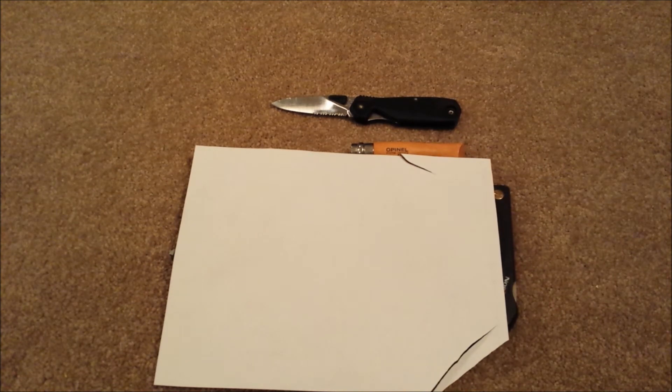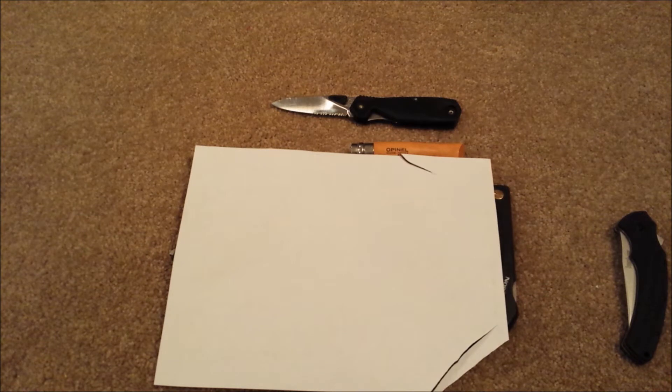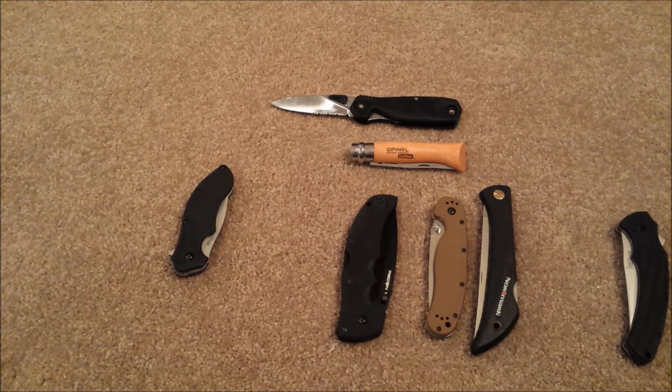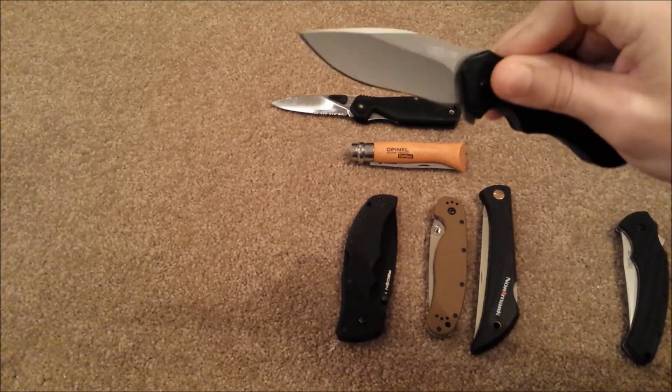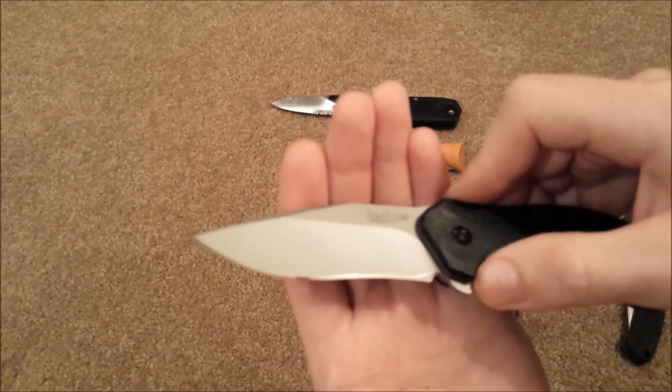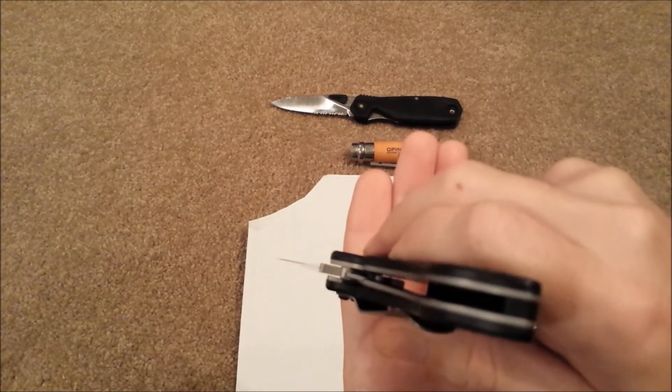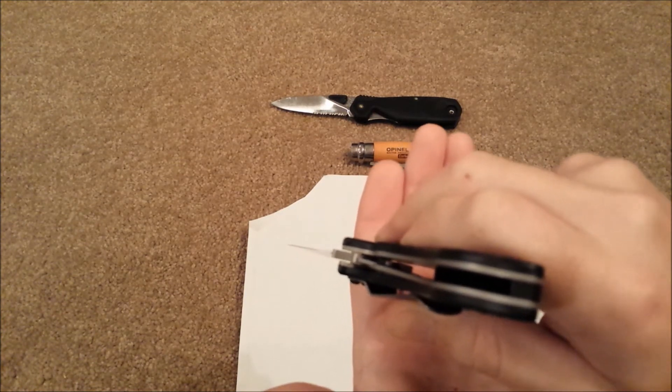For the combo edged version of the Trimmers, it's a little bit thicker. The actual straight edged portion of that combo edge, you're going to be looking at between 0.40 and 0.45 millimeters. The Kershaw One Ton is next on the list at 0.65 millimeters. Kershaw Compound is 0.4 millimeters. Kershaw Clash — this is another one I want to note because the Clash, at least mine, consistently come in at 0.30 millimeters. It is ground extremely thin and cuts very, very well.